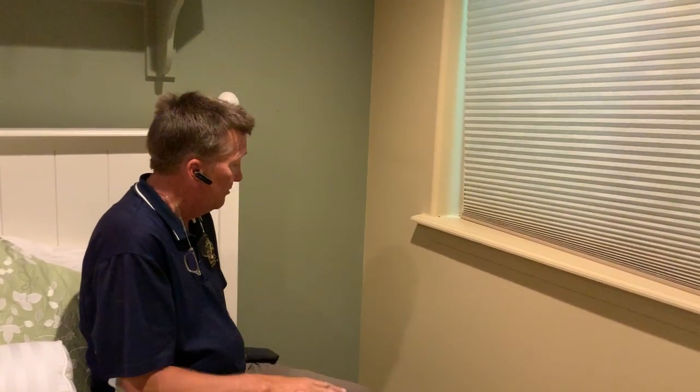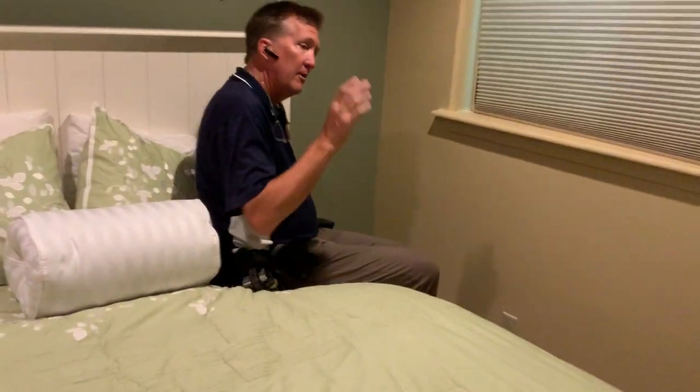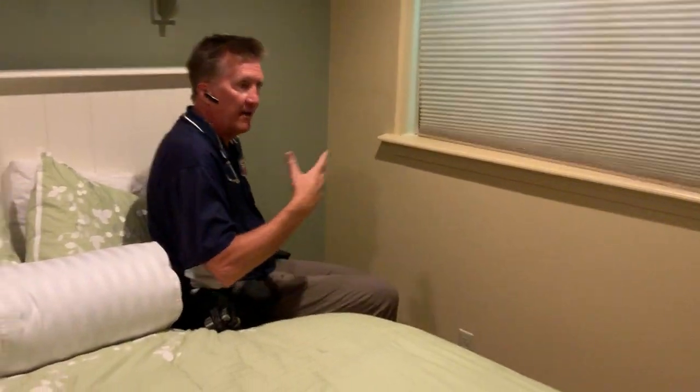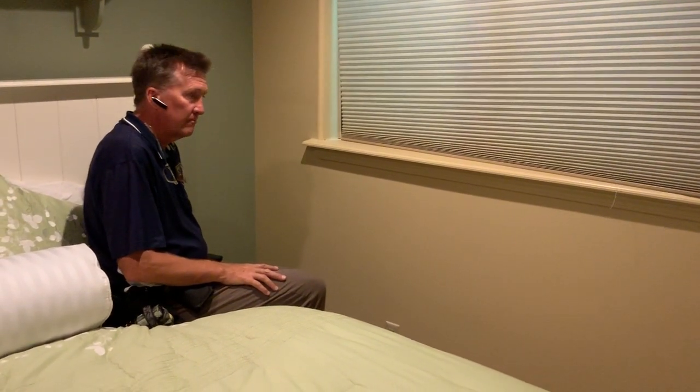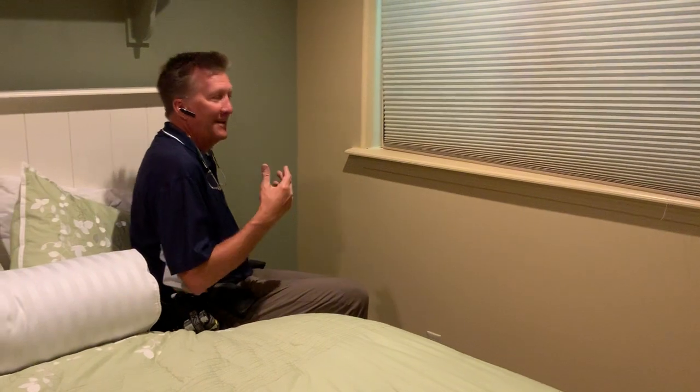the carpet tack strip. See, from my perspective in here, why not come through if you're going to re-carpet down here? And I don't know if you are or not, but if you are, rip all the carpet tack strip out, put in fresh so that you have that little litmus test now. You can pull the carpet and go, hey, it's still pristine. No water's coming through. But nobody looks at carpet tack strips except you. I'm talking about a homeowner.